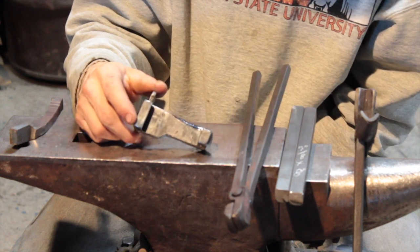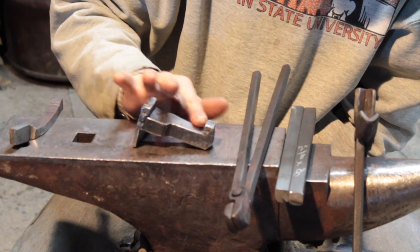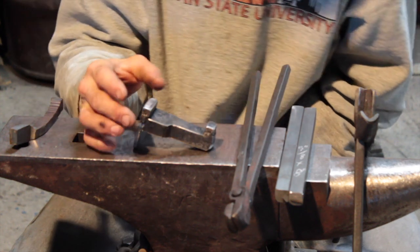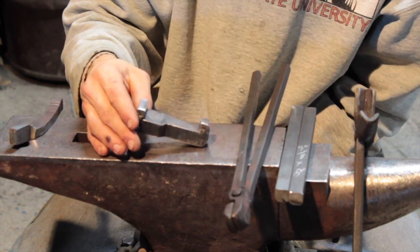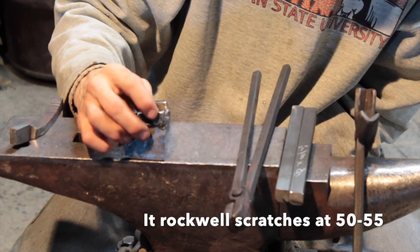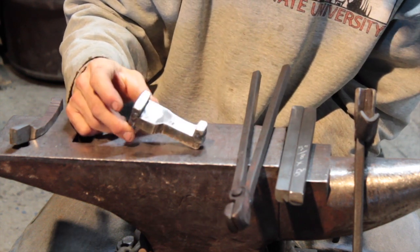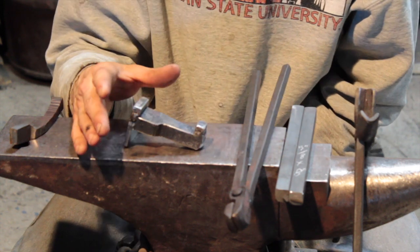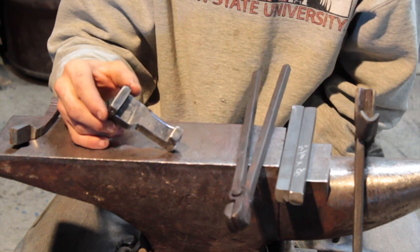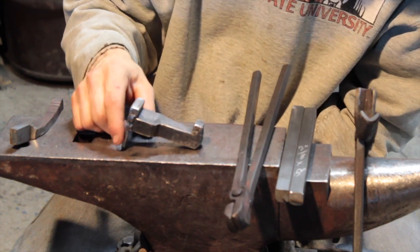My power hammer dies, I usually just quench them in oil and then, old school, rub them with a file or something until I can see that straw color come back in, till I know it's been softened a little bit. And of course, if you weld your little stops on, these are also out of sucker rod, you just want to tack it to get it in place and then heat it up red hot and then weld it really good. It still might crack out someday, but it'll be 5 years down the road instead of 5 minutes down the road, but that probably goes without being said.